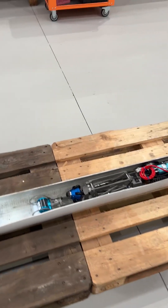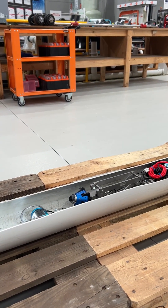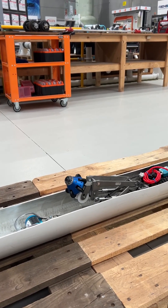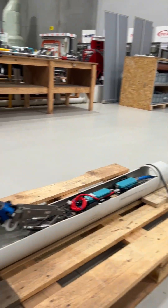We're now doing a very quick demo just outside of a connection, lifting up the lateral. It's operated by hydraulic pressure — now lifting that up and getting the push rod ready in connection. That will now, at the back of the crawler, drive the rod up.